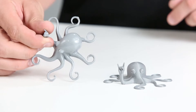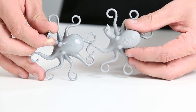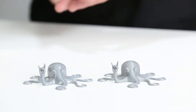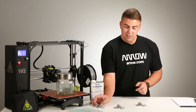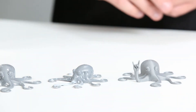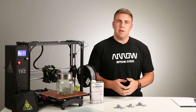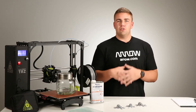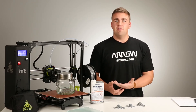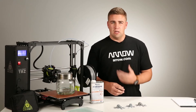Really on this part, the only place you can see the layer lines is on the very top, and it's still the most subtle thing. We had exposed this one to about half an hour of vapor bath. But what happens if you overexpose it is this creature — as you can see, it almost completely dissolved. That's actually how we came up with the idea of using a limonene vapor bath, because when you have two extruders, you can print with ABS and HIPS material and then submerge it in limonene to dissolve all of that HIPS support material out. So it's a really nice way of using support structures with a not-super-high-tech 3D printer like the LulzBot TAZ-6 if you have two extruders.